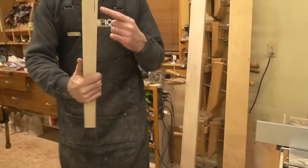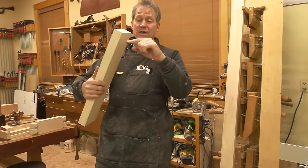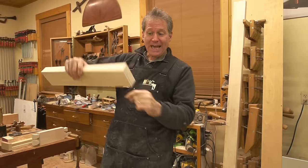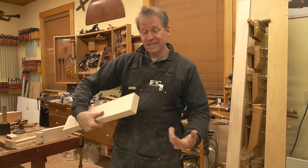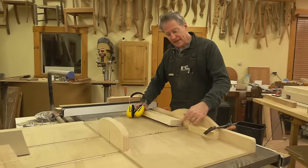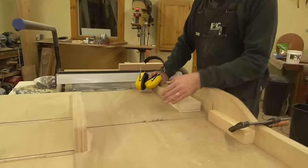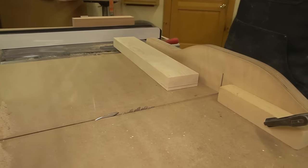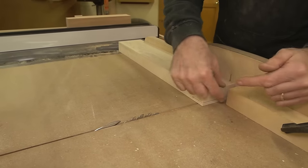With that done, now we can head over to the table saw and make the cross cut here, so I'll get that ledge I was talking about. I'm going to flip up on edge and make this little side cut as well on both sides. The table saw blade is up to just about three-eighths of an inch to just touch that side of the tail. I'll make this in two passes so I don't trap that cutoff piece.